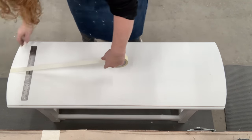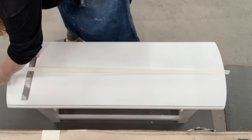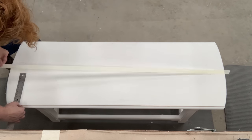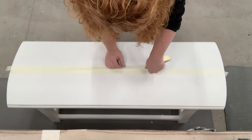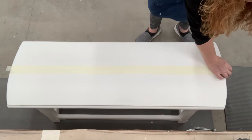Another thing that is a good seller for us are just simple white benches with simple grain sack striping. And you all know, if you're a regular to our channel, that I love to do grain sack striping. So I just have the regular Dollar Tree masking tape and I'm finding my first center point with that piece. Now that I have my first piece centered, I'm going to lay a piece of the same size masking tape on either side of that original first centered piece.